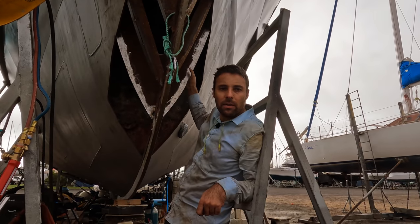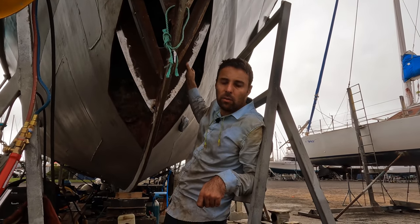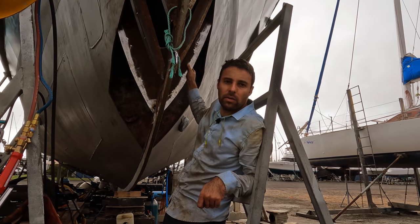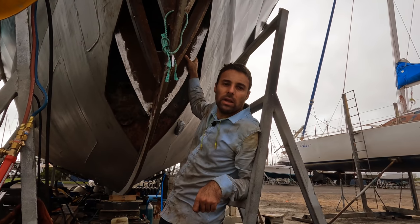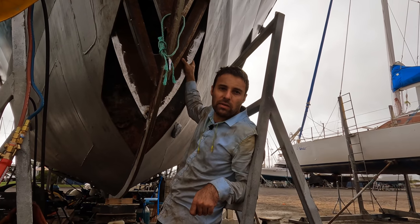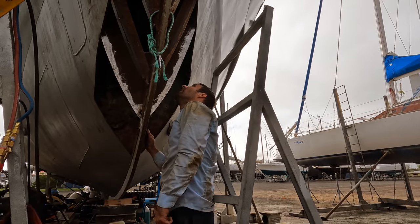And what about when the boat's moving, the torsion, all of that? Does 5mm out from perfectly straight matter? No, it won't make any difference whatsoever, because the welds come into their own then. It's more about welding strength when you've got torsion and twisting. The 5mm is pretty much irrelevant. And like you say, you can only do what you can do.